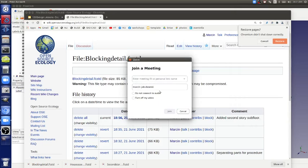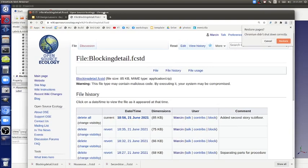Okay, so what's the rationale there? You have 5.5 minus 1.5 minus 3/4 for the plywood width. Is the plywood inside that or outside that? I would assume it's inside, but maybe not. Why would it be inside? What's the reason? You want it flat with the wall. The interior is on the outside, so you want to go straight up with it so it's smooth and you don't have a jump there. So it would be outside. Outside there, so it's the plus.